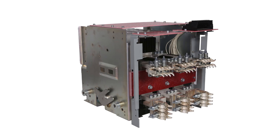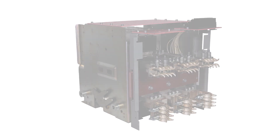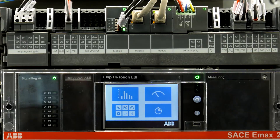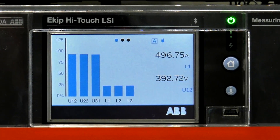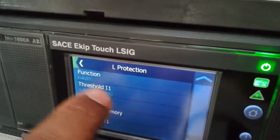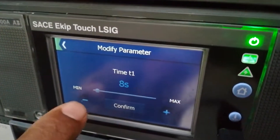Take advantage of single-cluster design to reduce the number of failure points and help provide a solid, reliable connection with the direct replacement solution. E-KIP trip units transform your breaker into a power manager with an all-in-one solution to manage your low-voltage distribution system. Embedded functionalities allow you to customize your trip unit by selecting the set of protections, measurements, and logics.